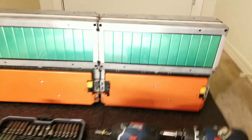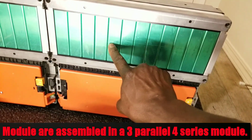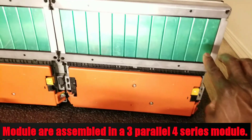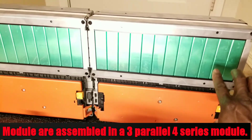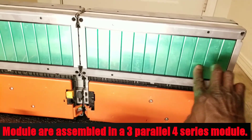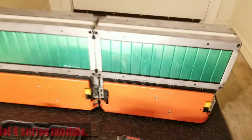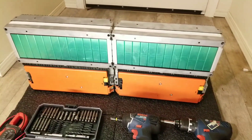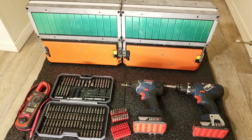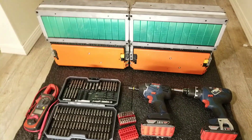You can see at the bottom part of the battery right here. If you count these batteries: one, two, three, four, five, six, seven, eight, nine, ten, eleven, twelve. So they said three parallel four series — I think it's three, six, nine, twelve — so it's four groups of three. That's how they paralleled them in threes and put them in four series modules.